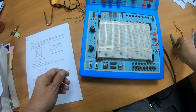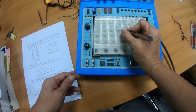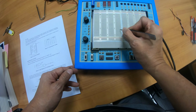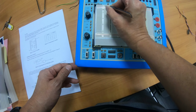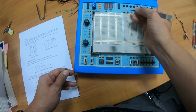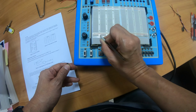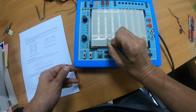The reason is that for the breadboard over here, you see a lot of holes. The 6 holes that you see horizontally, this set of 6 holes, belong to one group. So every set of 6 holes is one group. Over here, you see this long black line. This means that these 4 sets of 6 holes, altogether 24 holes, belong to one group. They are all connected underneath the board. For the shorter red line, it means that this group of 12 holes is connected. The black line indicates that the 24 holes are connected.